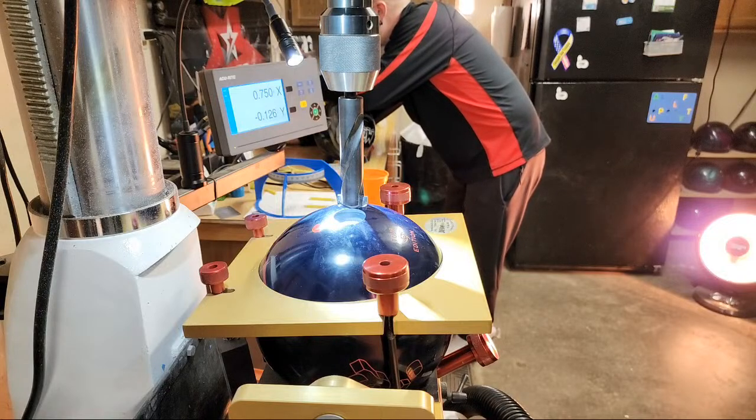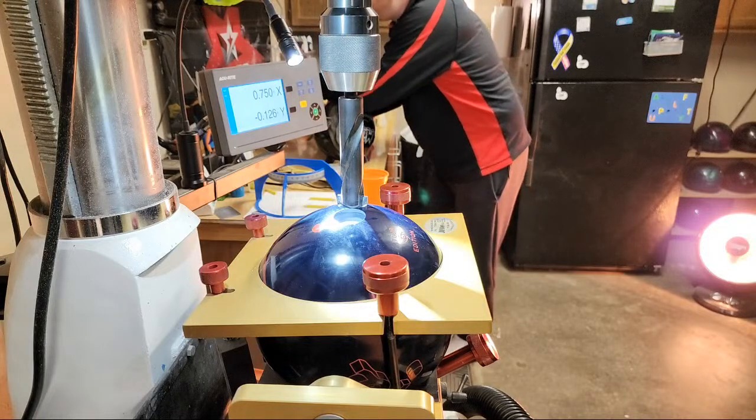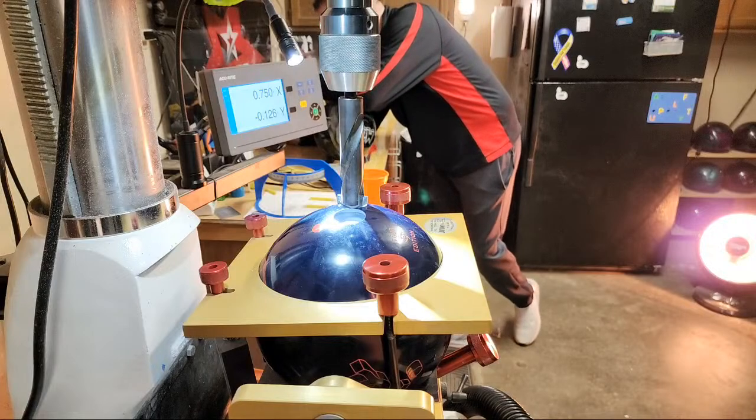When you drill out that old slug, do you have to have the customer pitches, or you just drill out? You have to have the pitches. James answered that, but you also have pitch gauges that even if you don't know what the pitches are, you can use a gauge and figure it out.